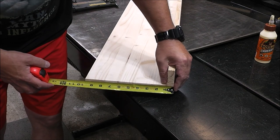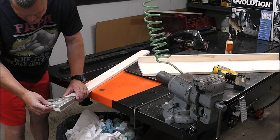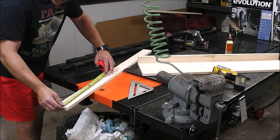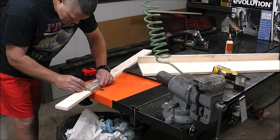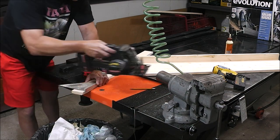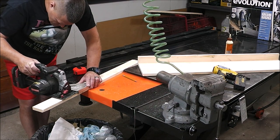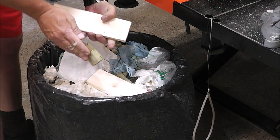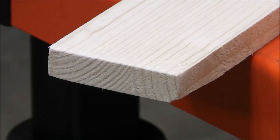We're going to make this nine and a half inches. I'll check my first cut to make sure that's straight, mark it at nine and a half, then speed cut it. Then just take a little piece of sandpaper, buff up the edges, get any rough burrs off it, and I can get the rest when I do my finished sanding.